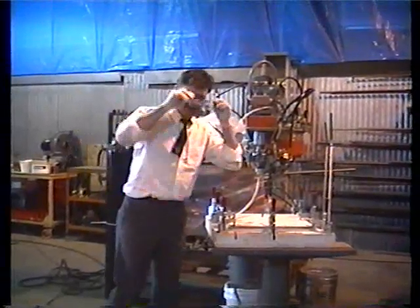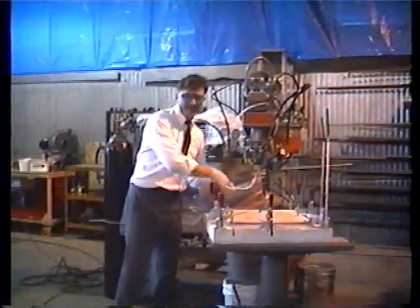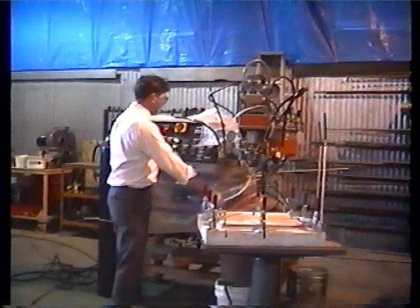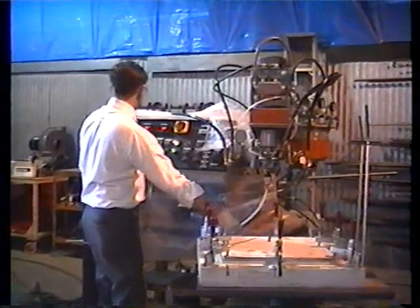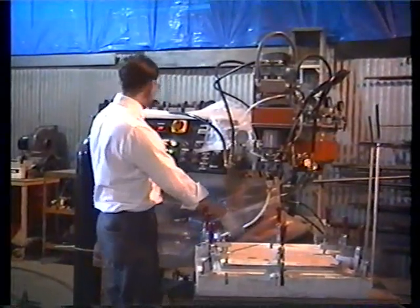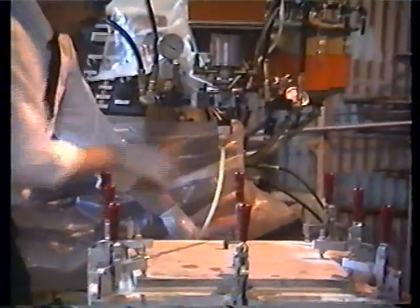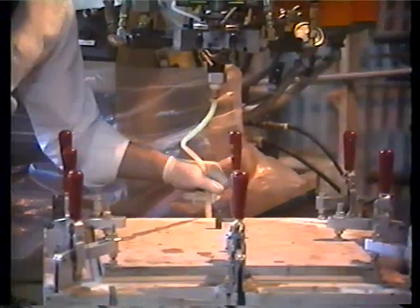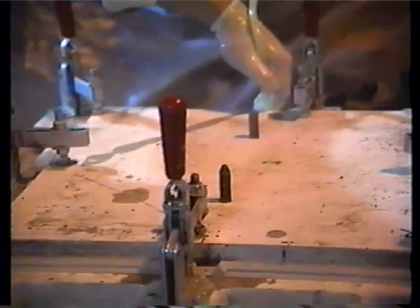We're ready to pour again. First and foremost today is safety: safety glasses with side-shield protection, especially when using the urethane machine. Don't forget that. Also, we have protective hand covering, protective clothing, and protective shoes. We're going to start our mixer — it's already calibrated once again. Mixer starts. Starting the pour. Good flow. We're doing the insert into the pour hole. Once again using our Series 200 North American Urethane Mixing Head with the conical mixer, reducing air entrapment.